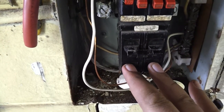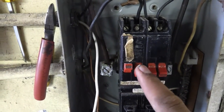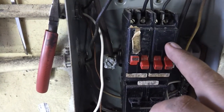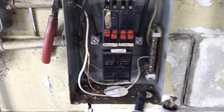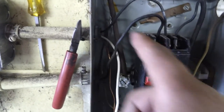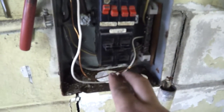This is your 220 breaker. You know this because it's got this big fat plug, and it's the equivalent of two of these. This is a 110 breaker — this is actually like a split breaker. Each one of these switches is a 120. On some fuse boxes, one of these whole boxes will just have one switch — it's still a 120. This is a new setup for people that run out of space. In my box I don't have any more slots, so they put these types of breakers in here, which gives you the ability to put two more breakers in. So this is a 220 breaker, the equivalent of two of these. You've got 110 going in here, 110 coming in that line, 110 coming in that line, and each one of these wires is a separate power for each plug. How a 220 works is it's combining those, adding them up — 220 is two power wires instead of a ground.